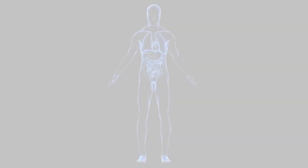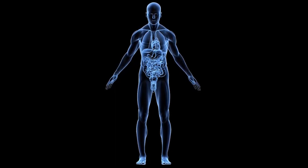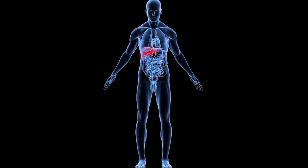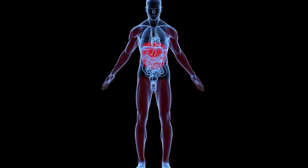Next, we see the maximum elongation, which we need to factor into our clearance calculation. The maximum arrest force is listed as 900 pounds force, which simply means that as long as you use the equipment properly, the energy absorber will keep the arrest forces felt by you to no more than 900 pounds force as your fall is stopped. The maximum force the human body can endure without injury is 1,800 pounds force. Arrest forces exceeding this limit can lead to serious injuries, including ruptured intestines, fractured liver, organ displacement into the chest cavity, and fractures and tears to your extremities.